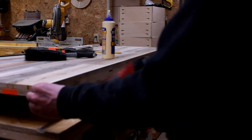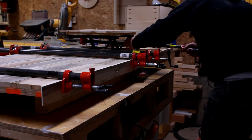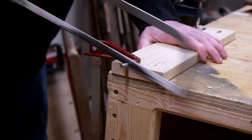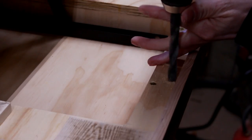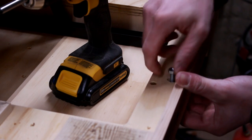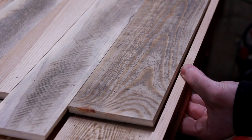I decided to go ahead and add the trim around the desktop using more pallet wood. I glued the trim on and threw a few brad nails in to hold it in place long enough to clamp it to the table. This desk was already taking much longer than expected, so I made a quick and simple latch that will open the hidden compartment using a bolt and nut. I cut the bolt down to size then countersunk a hole to allow the nut to sit below the surface of the desk. It isn't fancy by any means but it will be hidden from plain sight. One bolt is just fine for opening the door so I didn't need the second hole I had previously drilled.